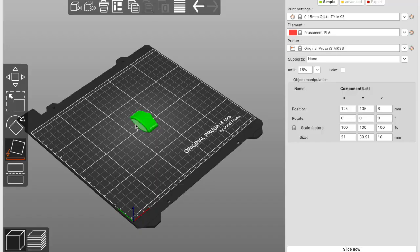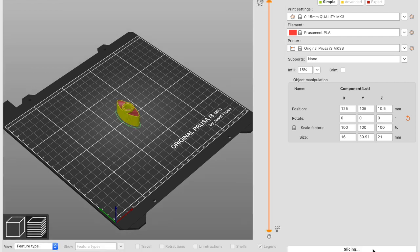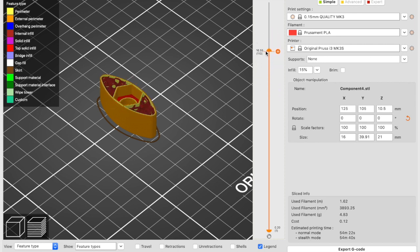So this is the part I'm going to work with. Let's face it up and slice it. There's a bar here and you can drag it down, then press the plus icon to pause your printer, and then we're going to put the nut inside.